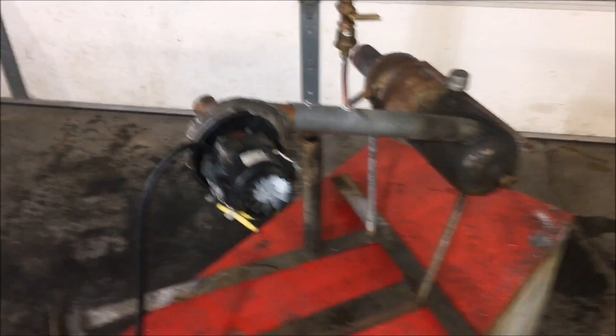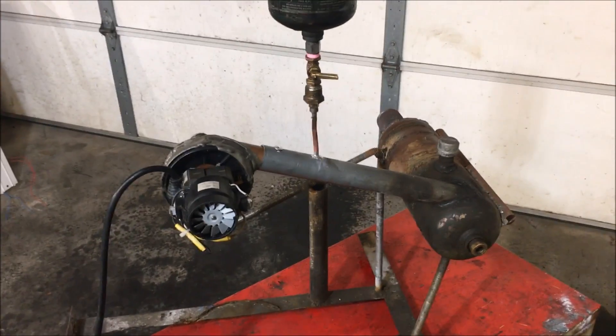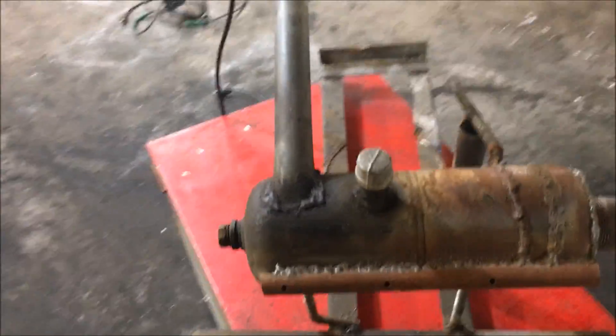The reason I like these drip burners better than spray nozzles is because you cannot adjust the air-to-fuel ratio as well with nozzles. I can burn a super lean fuel mixture in this thing and get an almost white-hot flame coming out like a rocket cone — it'll almost have shock cones in it. With spray nozzles you get one type of flame and that's about it. With this, at the same air power, you could have a four to five foot flame out the front, or a super white-hot rocket flame about this tall. The ability to adjust air-fuel ratio is a really cool feature.